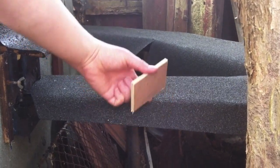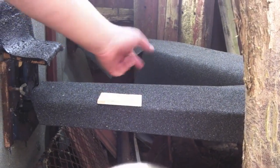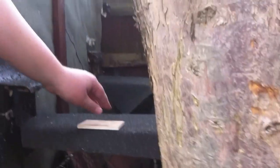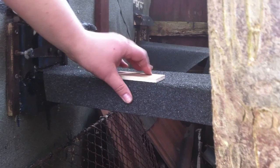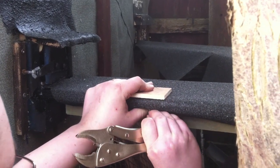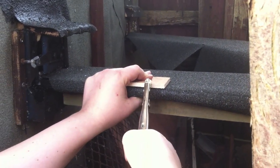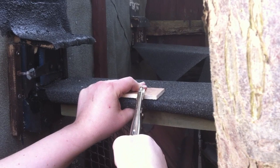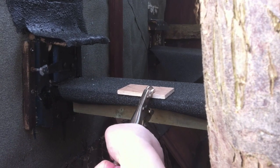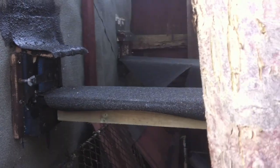You can see that because of the bend in the roofing felt it's sprung a little bit on the edge. The glue's actually still sticky underneath there — it seems to take a very long time to cure. It's quite a tight restricted space, so positioning the wood on the edge and getting down nice and low, folding the roofing felt over and just — with your thumb — push the little tack nail just into the roofing felt, then clamp the wood over the top. That piece of wood makes sure the clamp doesn't damage the roofing felt, then we just squeeze that nail in. Nice and neat.